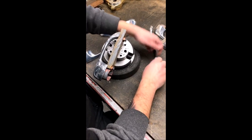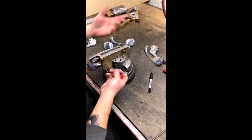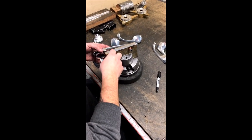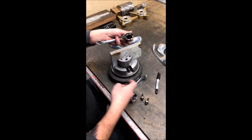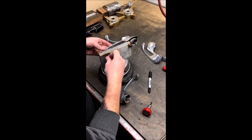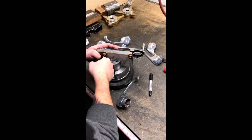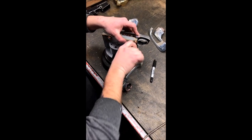The other way I do it, I'll show you guys, is I just mount this into a little block of wood. It's nothing fancy, just a little homemade jig. It's worked for me for years. It's just a little piece of wood, and it usually works on most Impala door handles, most years. Tighten this up. You don't want bolts too long because they will pop through the casting on the other side, and that's not fun to fix on somebody's door handle.